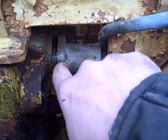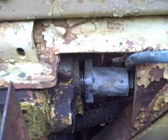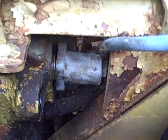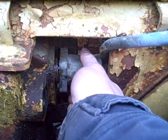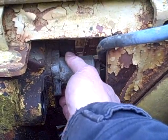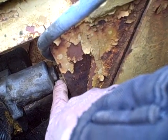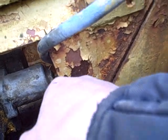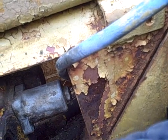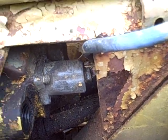When I open this up I can see the spring assembly that I assumed would be on there, which would keep me from being able to pull the spool out in this direction of the valve body. I've got to get that off first. I believe it's held on by a bolt on the end. The cover doesn't want to come off, so I think I'm going to have to take this nut off. What worries me is that it looks like it might be a locking nut for an adjustment — I really don't want to disturb that.